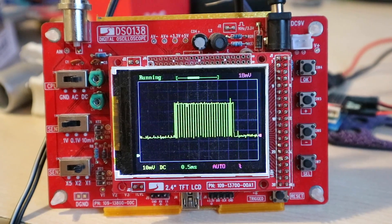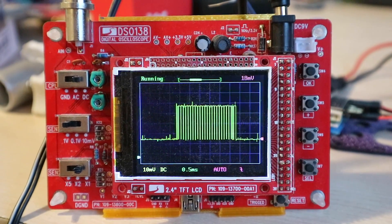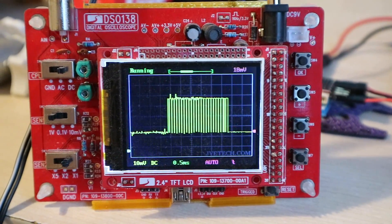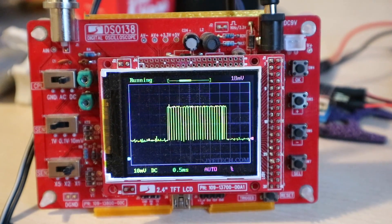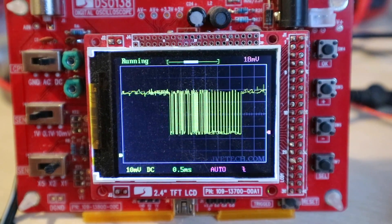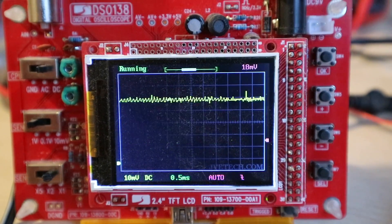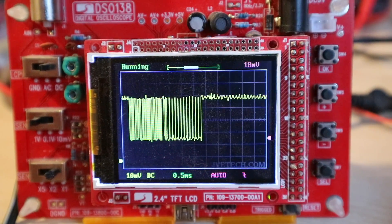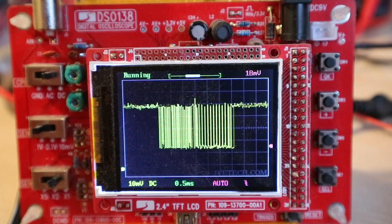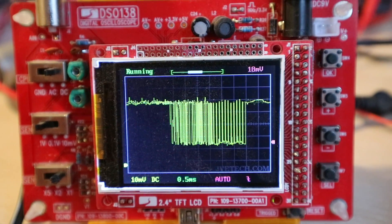Let's demystify what we mean by inverted and non-inverted when talking about UARTs. I'm on my little scope from a kit here, so it's a bit noisy, but this is the output from a FrSky X4R using an inverted SBUS signal. You can see there's a baseline and then the signal goes high — that's how ones and zeros are interpreted. On the flip side, using a full-speed RC uninverted SBUS receiver, it's the inversion: the zero signal is high and the actual SBUS signal goes low.